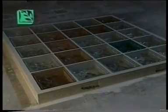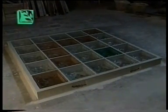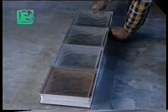In our first example, we will look at how to assemble a prefabricated panel for internal walls. We will be using pink, aquamarine and colorless transparent DO glass bricks with a wavy inside surface, measuring 24 by 24 by 8 centimeters.